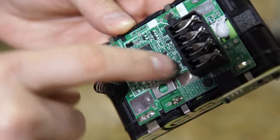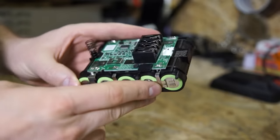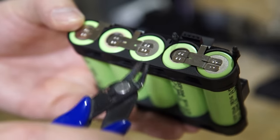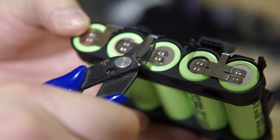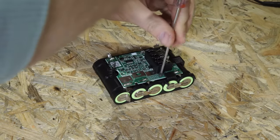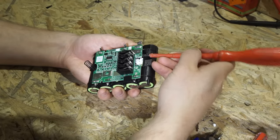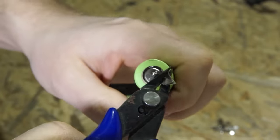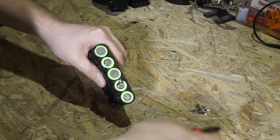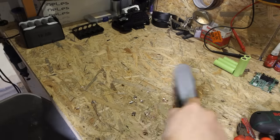With the latest iteration of the 2 ampere battery, the testing board is removable. I already removed endless amounts of nickel strips from other batteries, but with the ones from Parkside you need to be extra careful because the walls of the cells are a bit less thick — if you make a bridge movement with the pliers it's prone to tear a hole in the negative side. Better move the pliers from side to side. First cut the nickel strips connecting batteries to the board, then remove the screws holding the battery management system. The board is still stuck from heat plaster holding the temperature sensor — just gently pry it up with a screwdriver. Carefully remove the nickel strips by side-to-side movement; cut the connected ones in half first, then slide out the batteries. These cells can be used to upgrade a 2 ampere battery pack. Don't forget to clean up so you don't get a short later on.